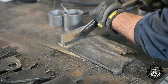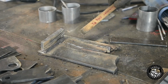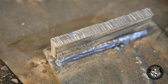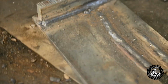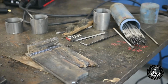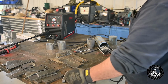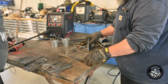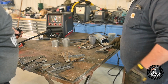I do that same thing with a MIG with thinner metal. I wish I didn't have that spatter on there, but I mean the weld, well, it looks great. I think you can see there's no undercut, no non-fusion. Pretty good, and that's 3/8 plate, half-inch plate welded to the 3/8. Yeah, exactly. No, it's pretty impressive. Huh, that's cool. But yeah, it's pretty darn good. I wouldn't hesitate to use that on anything.